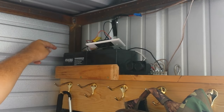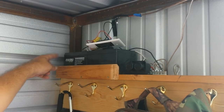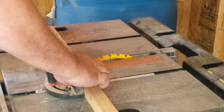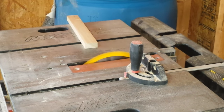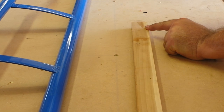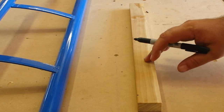I'm just gonna cut a piece of board to go across the top here and hook a J hook in here to hold it down. And then over there I'll put a spring, and that way we just tighten this one up and that should hold the batteries down just fine, keep them from bouncing around and popping off. So I went out and measured — going one inch from this edge, one and a half inch from this edge. This will be the J bolt and then this side will be the spring.